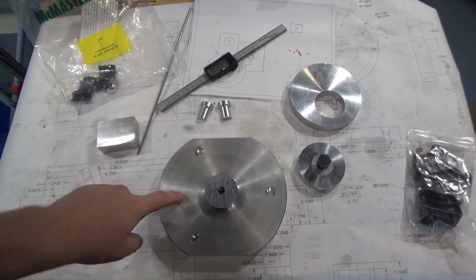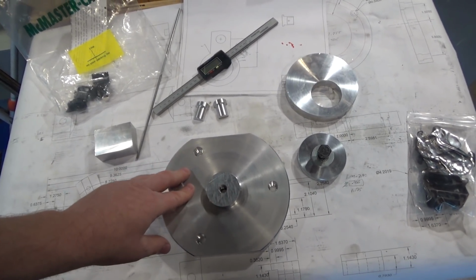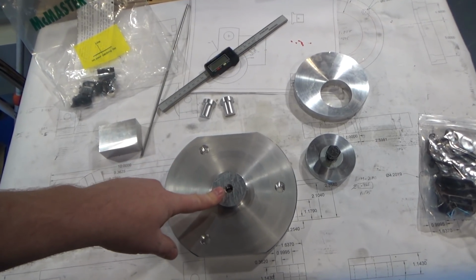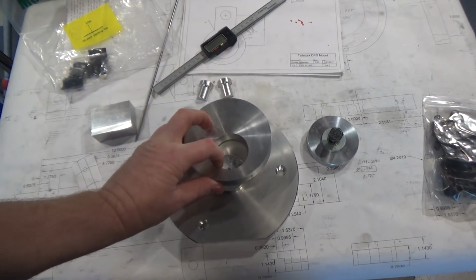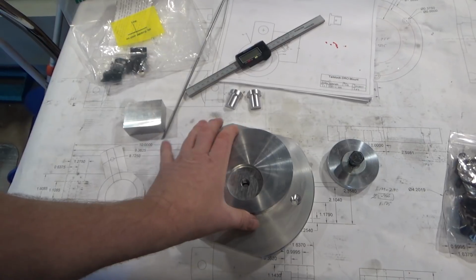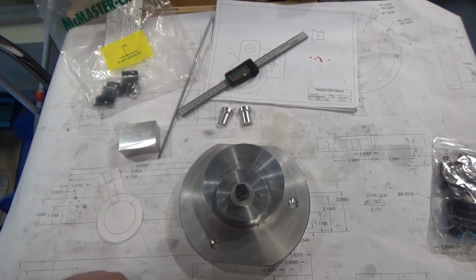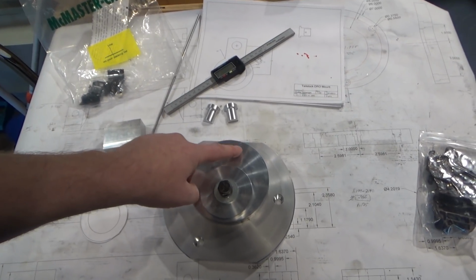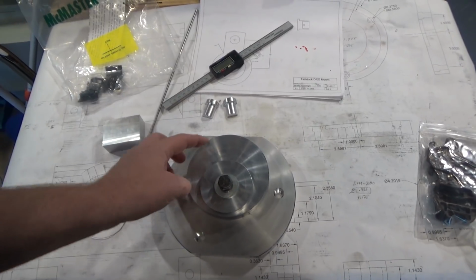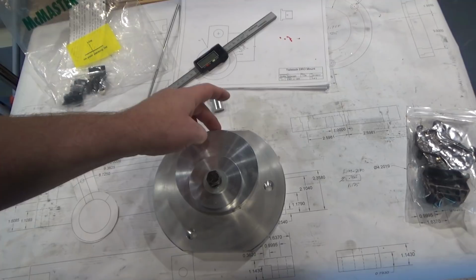So next up is getting this guy, the fixture, onto the rotary table. First get the rotary table aligned on the mill. Get this guy on the rotary table and aligned with a spindle. Get this guy and put it on, ready to cut and align vertically the way I want. And clamp it down with the hold down piece. I'm still debating whether or not this part, this section that sticks out, is going to need some additional support. It's fairly thick, so I think if I take small cuts, it'll be all right, even though I'm going to be taking a 3/4 of an inch cut.